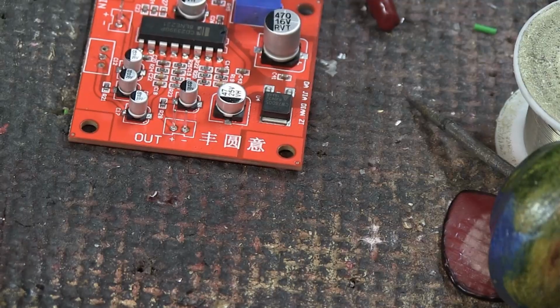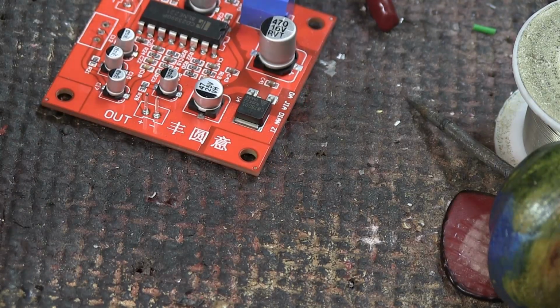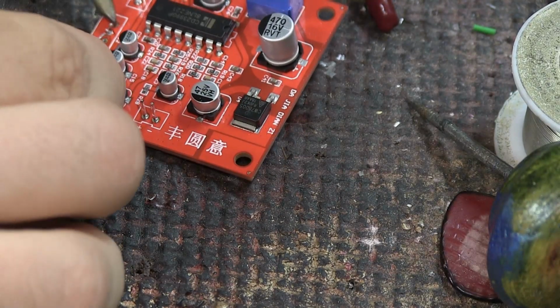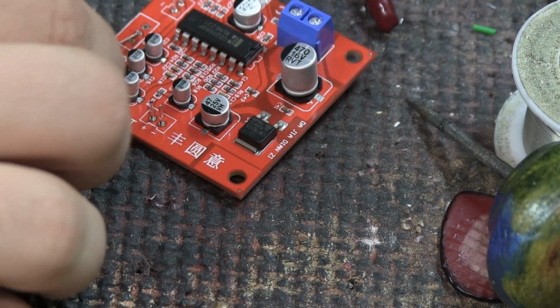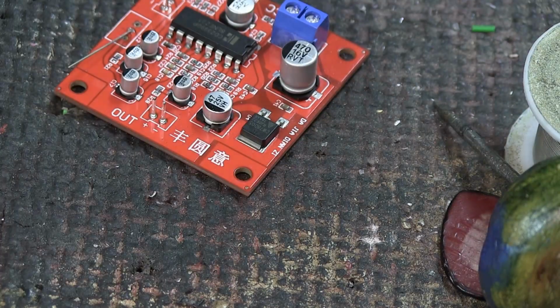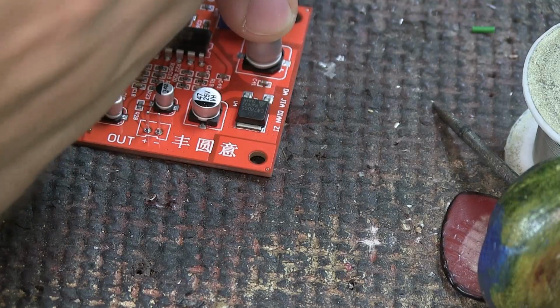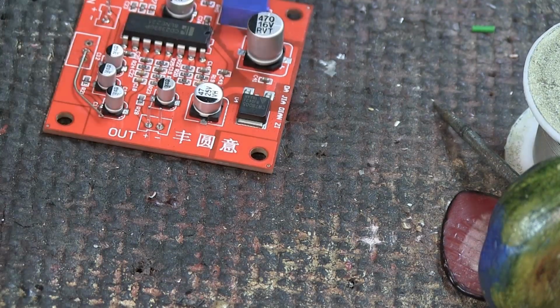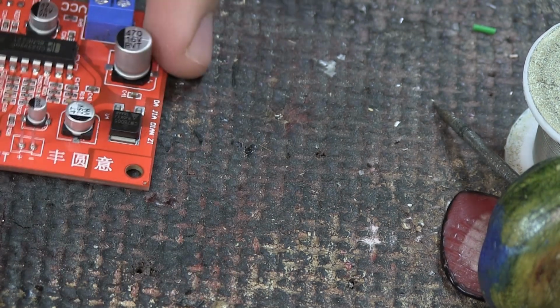But try to do this so that nothing breaks. Okay, so I accidentally broke the connection for the pins to go into again. Both of these I did that on. So I'm just gonna solder that in place right there, and then I'm just gonna try to press this down in place and bend it so that it gets connected over there, and cut this down to size just because I don't want it going in all directions.